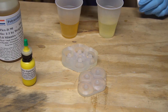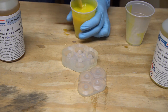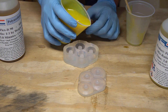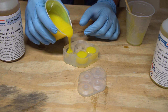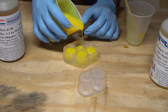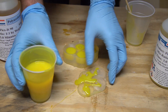The first thing you need to do is mix up a batch of urethane. For this cast, I'm using Specialty Resins Flexit 90. I'm also adding a bit of yellow urethane pigment from the same manufacturer, just for color. I've designed this squish mold to be very easy to use — the parting line forms funnels that allow you to slightly overfill the mold, and that overfill acts as a resin reservoir. You also have the option of adding some resin to the lid of the mold, which depending on the resin can help eliminate bubbles.